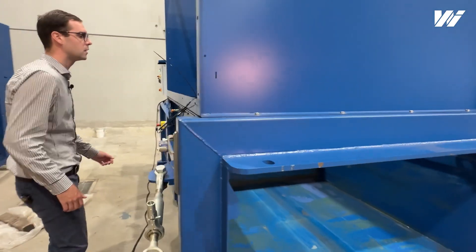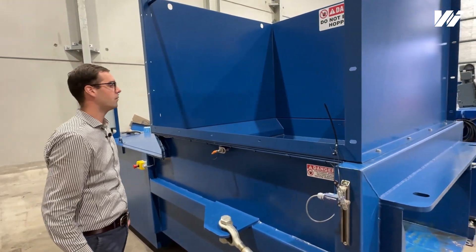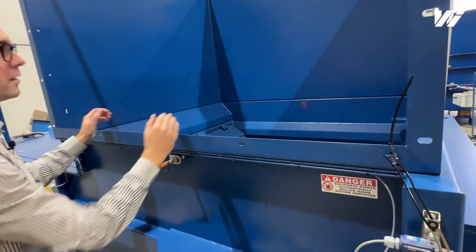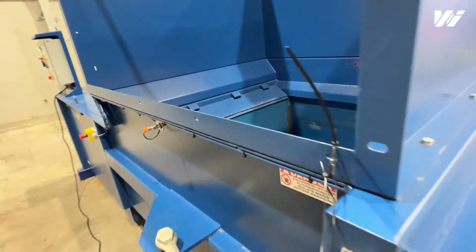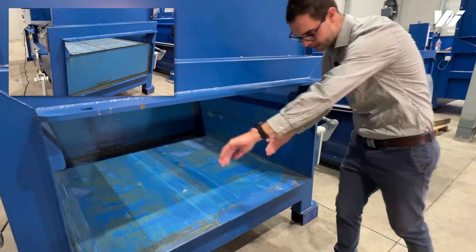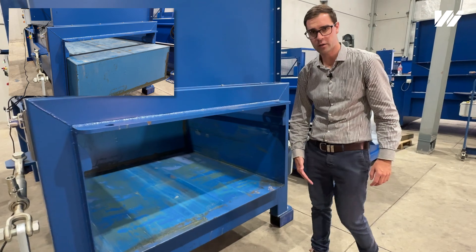The blade compactor system is really good for hand loading and really good for bin lifter loading. There's nothing to get caught on in terms of tangling up in the hopper, and it also avoids a lot of bridging issues. This system works with a platen here which pushes all the waste into the bin, so it gets a lot of waste pushing into the bin every single stroke.